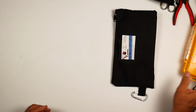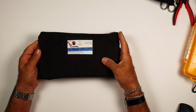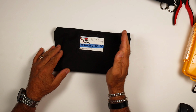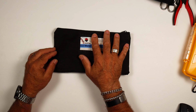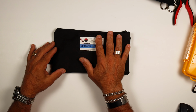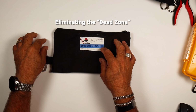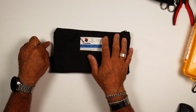They have multiple purposes. One purpose is that they move the front end of the OTDR out to the first connector. So in this one, this is 150 meters, so about 450 feet. This moves that front end out to that patch panel. What that allows us to do is fully characterize that first connector in the panel.